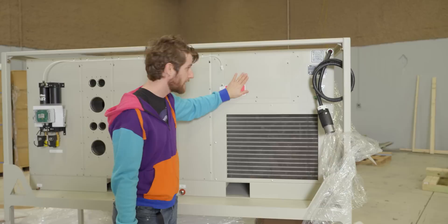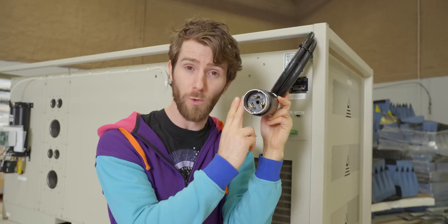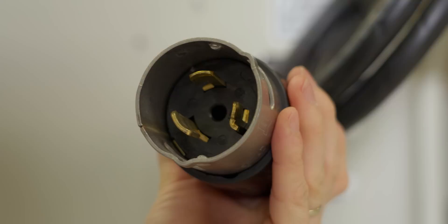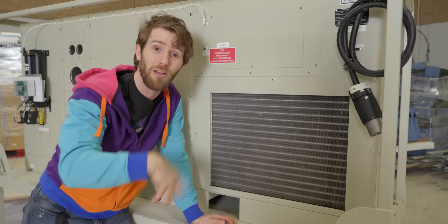This is going to help us root it out. On the back, there's power — this bad boy calls for up to 40 amps of 208-volt single-phase power and peaks at 8,000 watts. That allows it to go up or down 5 degrees in temperature per minute, all handled by the HVAC system here, which based on the size of the condenser could probably handle a small apartment.